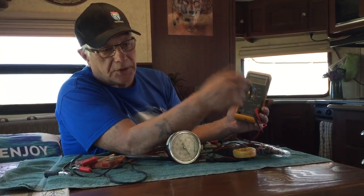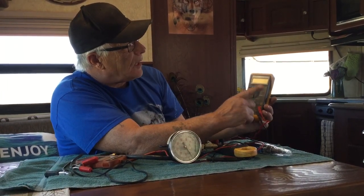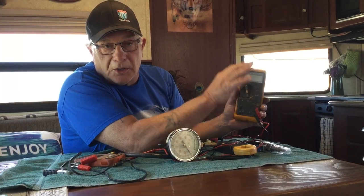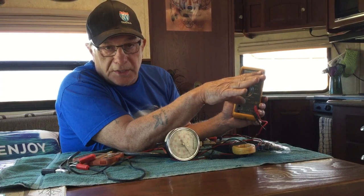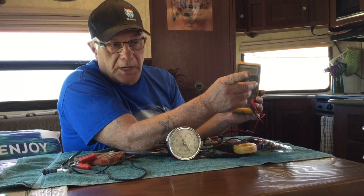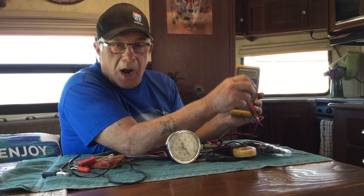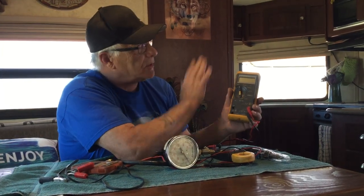If you want to get into air conditioning, look at Jax — there's a good video on it. This one is all electronic and it tells you Hertz too. If you don't know what Hertz are, it's the cycle which electricity works on, and 60 is the magic number. So if you plug this into your wall sockets and it comes up 50 or 45 on a generator, you might want to check why — usually it's idling too low, so you just bring the idle up a bit.